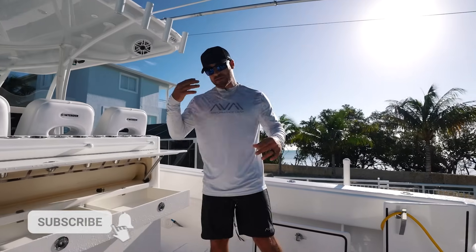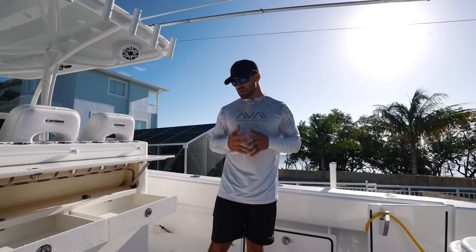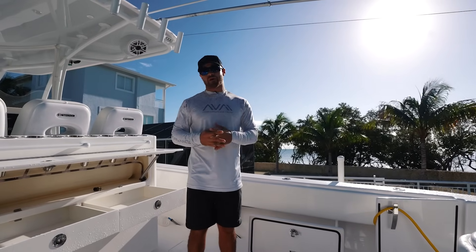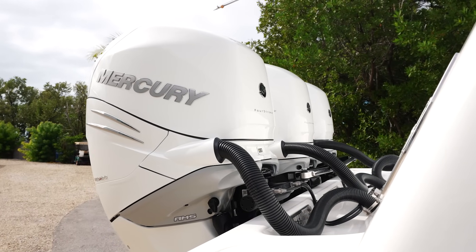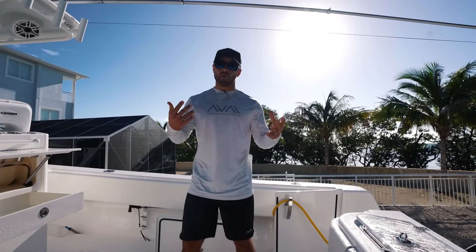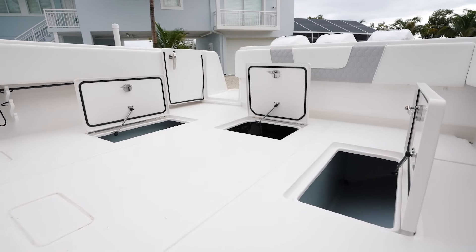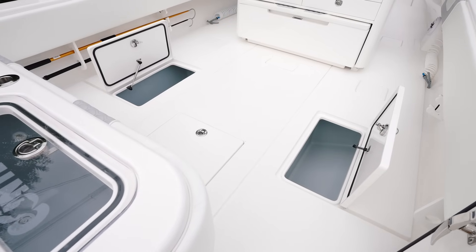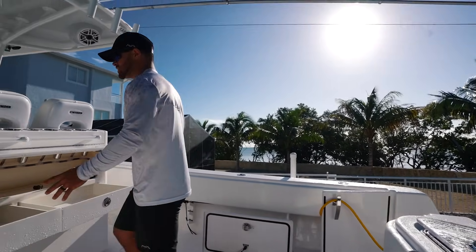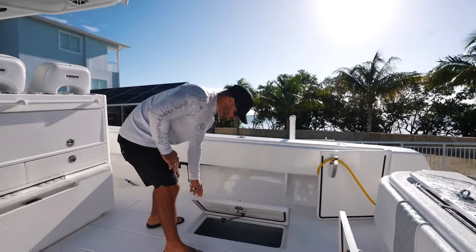Throughout the video I'm just going to be speaking my mind, giving you guys as many tips and tricks as possible and ultimately as much information as possible. Typically step one when we start, we take the cover off the boat. We don't have the cover on right now because we just did a service so it sat out overnight. We got some rain so things are a little wet. But typically once we put the cover on, the last thing we do is open up all of our hatches to prevent mildew from accumulating inside, especially if you're storing stuff inside the boat — that moisture is just going to make things really nasty. So we always leave everything open, and step number one we always close everything up.